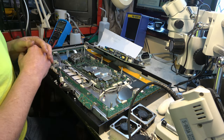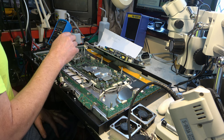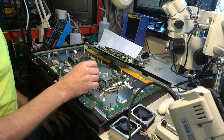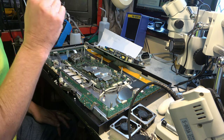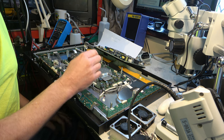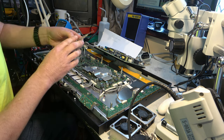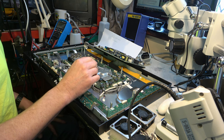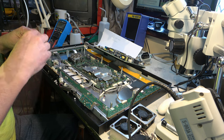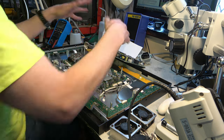Our big problem is it's so small and quite hard to access. What I did last time to operate the enable pin — I connected a 4.7k resistor to the 12-volt line and was able to access it via a dentist pick, giving me a way of connecting to that point and pulling it high. The 4.7k resistor was a bit low and the voltage actually went to over 5 volts, which is a no-no. So I'm going to use a higher value resistor this time. But I still have the issue of hooking an oscilloscope to the output of this IC.